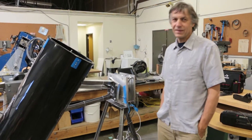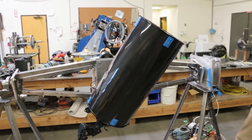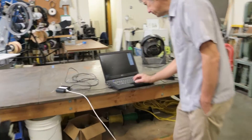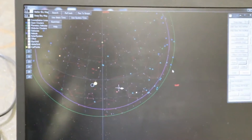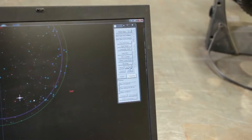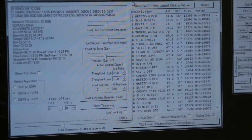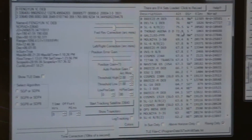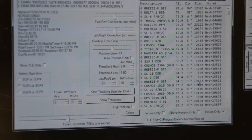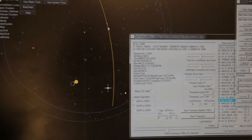Now we're going to try to track a satellite indoors. Right now we're sitting here tracking something at the sidereal rate. Let's go over to the sky view — I see Saturn over there, just click on Saturn and go to it. We go over here and click on sat track. I'm going to load up a TLE file that you download from the internet — here's all-sat, which is pretty much all the space junk there is. That's above horizon only, but I'm going to click rising only because we want them only to be rising. I'll sort by altitude so they're going to be high in the sky. Here's one that's fairly close — you can see the path, the little feller coming down this path.